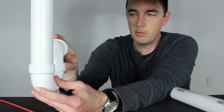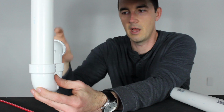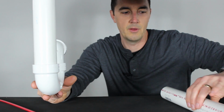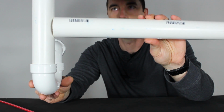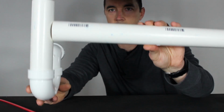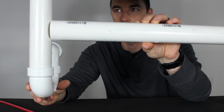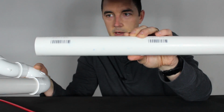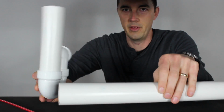So you'll probably have this on one sink or the other, not on both, but there'll be one drain line heading out of the house like this. If you have a double sink like what we have set up here, then you'll have another cross piece that connects the 2 sink basins. So you'll have a line like this, maybe running over to your garbage disposal, or just to the other drain line on the other side of the sink. This is the best pipe to use to set up your waste line, just because it's the easiest one to get to, and it offers a quieter operation than this style does.